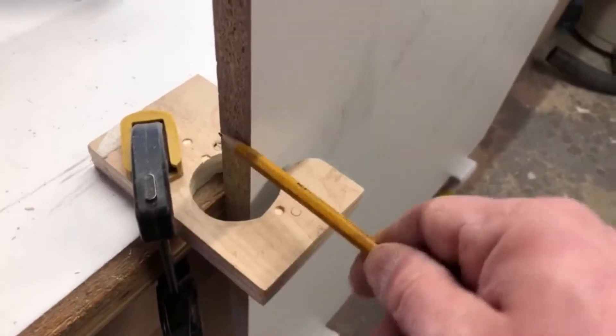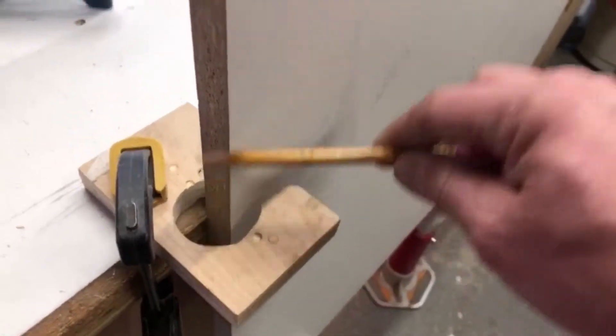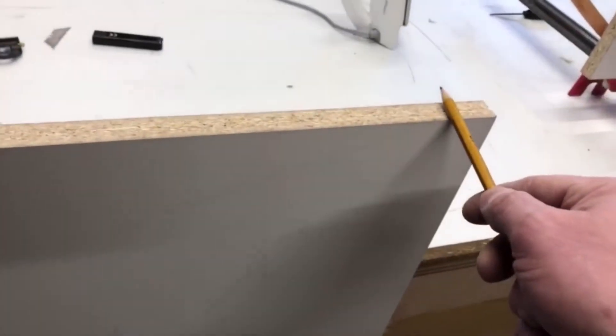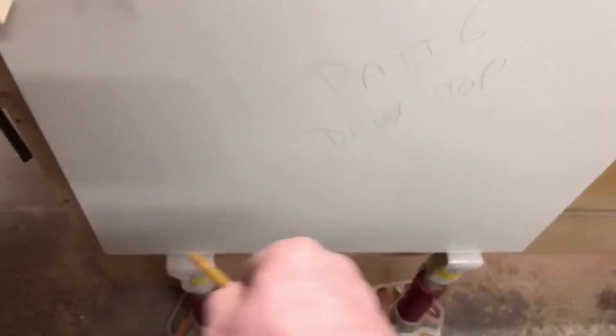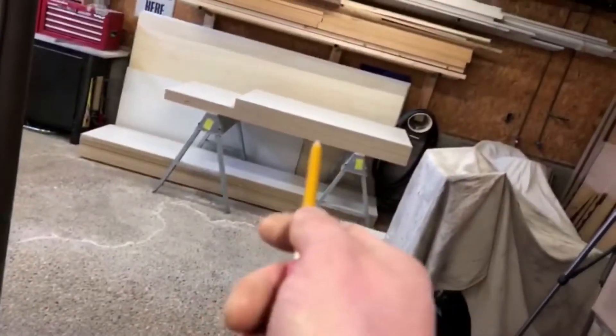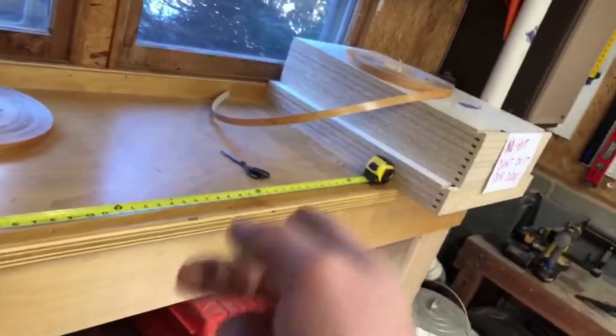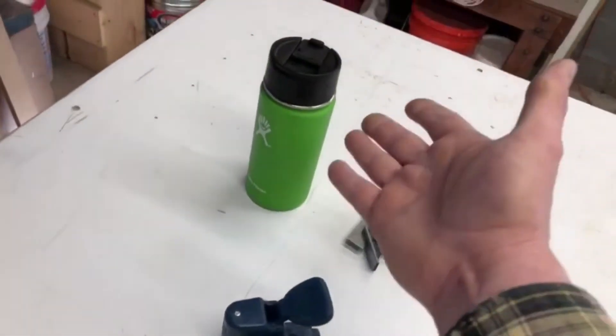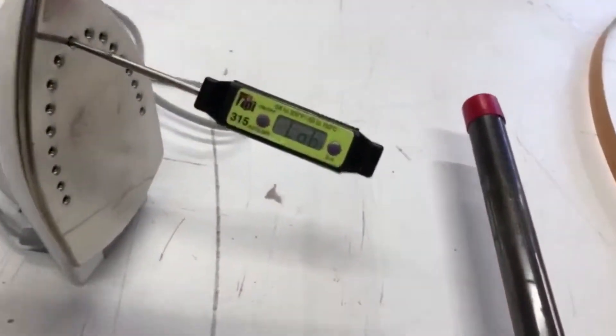There it is, clamped to the bench with my work piece in it. Got the relief cut so I don't chip out my edge when I'm trading pieces in and out. This is the edge I'm concerned about when I'm ironing. I got the back edge of the cabinet piece on the foam on the jack stands — I can move the jack stands to accommodate the big pieces. There's my stack of drawer rails; I can put them in the pipe clamps and iron those right there. This is my snipping station for the banding right here. I can work on my piece and reach all my tools and my coffee, and I got my iron heating up.